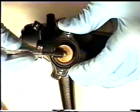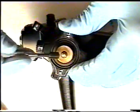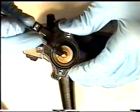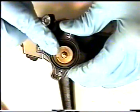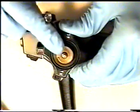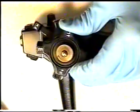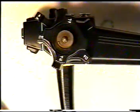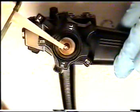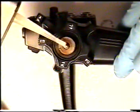Do not apply excessive force to these nuts on the shaft, otherwise it will break the control section shaft, which then will need to be sent to a repair facility because it is a very complicated repair. Again, do not apply excessive force to these nuts on the shaft. Use a small amount of Loctite to the top of the shaft post.